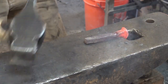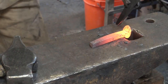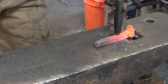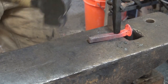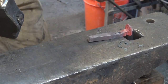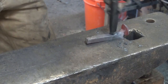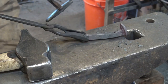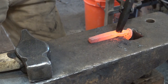I'm taking a look pretty much every blow just to make sure things look like they're going the way I want. The smaller bar cools off fairly quickly so we're going to have to get it hot regularly, but we're close to halfway through. Seems like I'm just a little off so I'm going to see if I can tip the punch and steer it the way I want it to go — it looks a little thin on this side and a little fat on that side. I'm dipping the punch in quick-and-dirty tool works punch lube to cool it and make sure it doesn't get stuck. You can put coal dust in there, dip it in water, graphite — there's a lot of different things you can use to keep a punch from sticking.